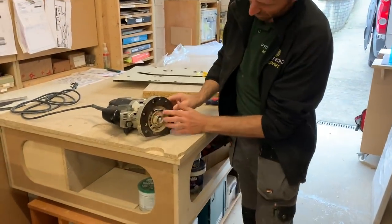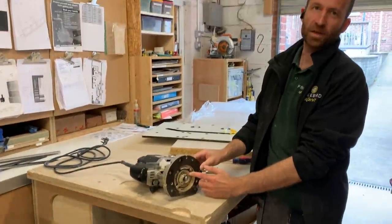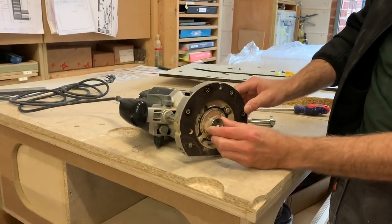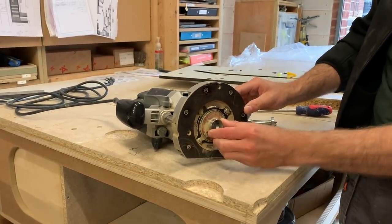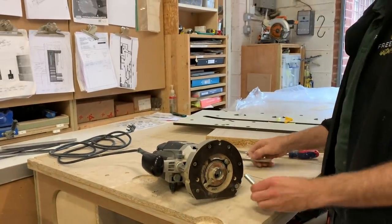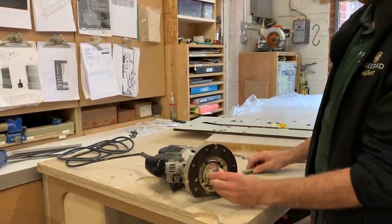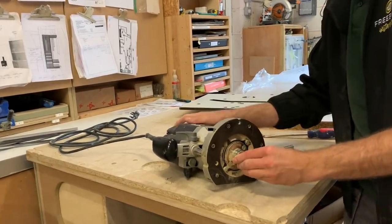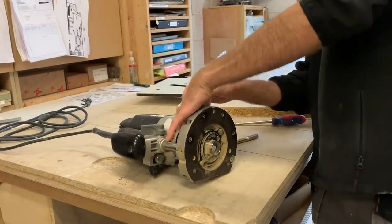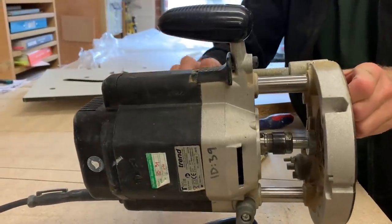Okay, so the bushing there into that black thing, that's like a countersunk screw that's going to self-centre. So that, for what I'm trying to do now, that may as well stay locked in. This black backer, you see it has a bit of play. This thing has a half inch shank, same as a standard router bit shank, which means that once it's in and tight, it's centered. It's going to be like a center guide in the position that any router cutter would be in once it's tightened.